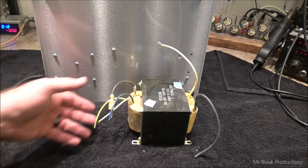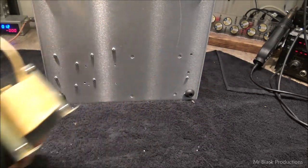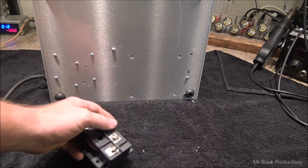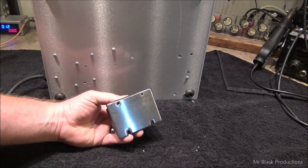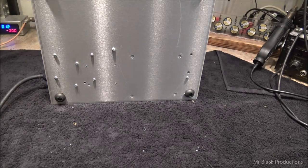I mean, personally, I don't think these switchers are going to cut the mustard once we add the bias. And we might have to go back to this heavy bastard. If that's the case, it's not that I don't have the parts. Instead of building one of these shitty 50 amp rectifiers that are submerged in gray plastic and metal, we found these 200 amp bridges work scootchin' better. And it's not going to be a lot of work to convert the two over. But I want to play with the switcher the way it sits. I'm going to build some confidence in it before I can give a thumbs up or a thumbs down to leaving them in there.